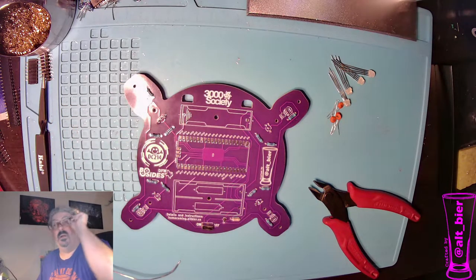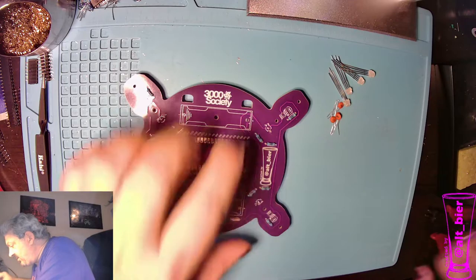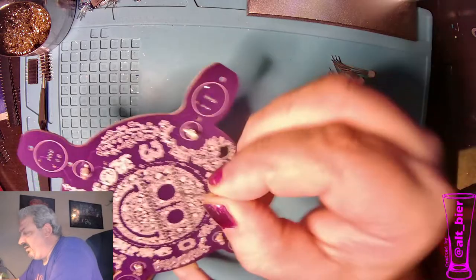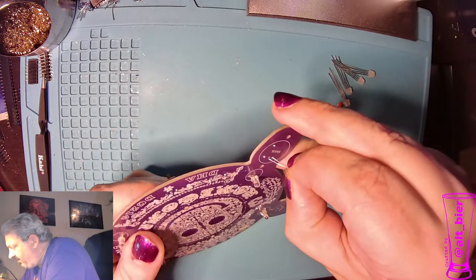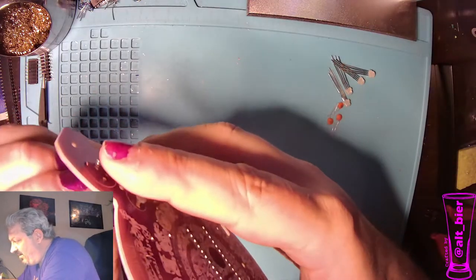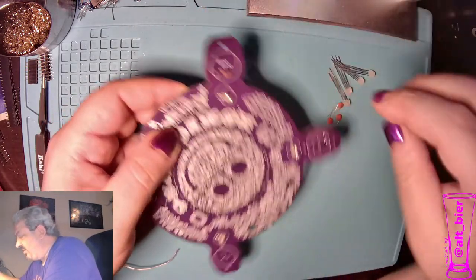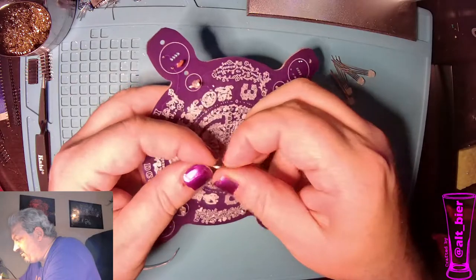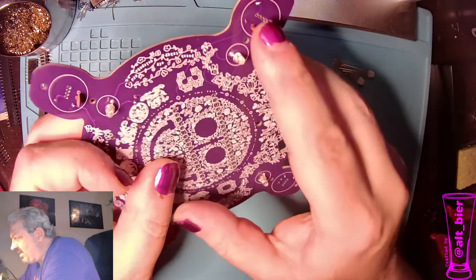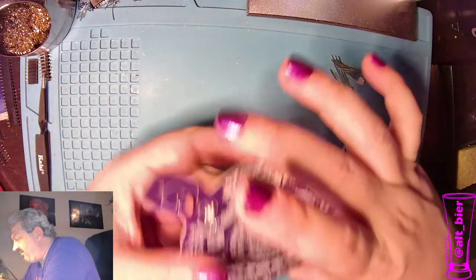Okay, and so the next part would probably be the ceramic discs, because they're going to go in between the two LEDs. And the reason that I decided to put these guys on the front of the board like this is because they act as kind of a light blocker, because the two LEDs are going to be shining light that's being diffused by the 3D printed housing. This kind of stops them from bleeding into each other in that middle section between the flower and the leaves.